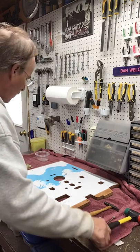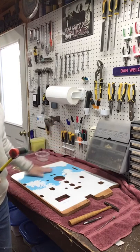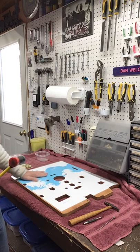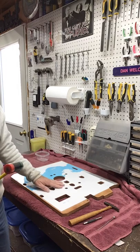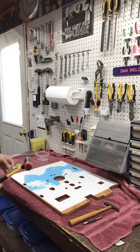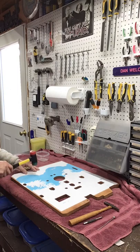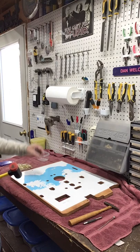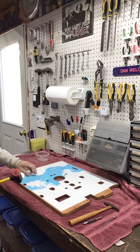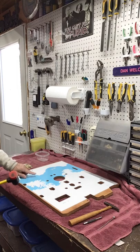It really doesn't matter where you start. You want to have a picture of the original playfield for reference. I've done this enough that I know where the nails go, but you've got a lot of holes here and not all of them are for nails. You're just going to start where a nail is supposed to be and use the soft mallet to tap it down until it bottoms out. The hole was drilled to a certain depth, and when you drive the nail back in and it hits bottom, the nail is back to the right height off the board.